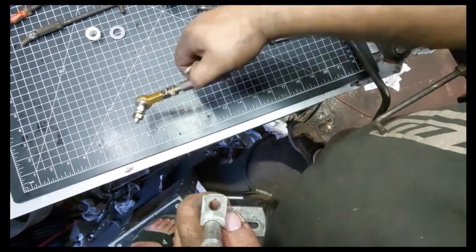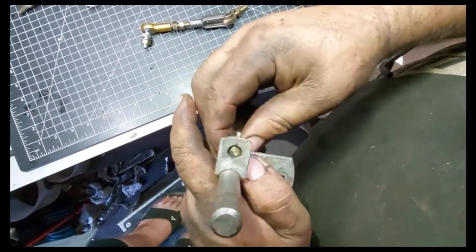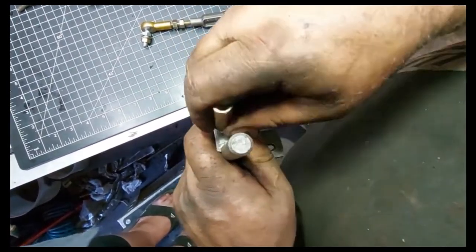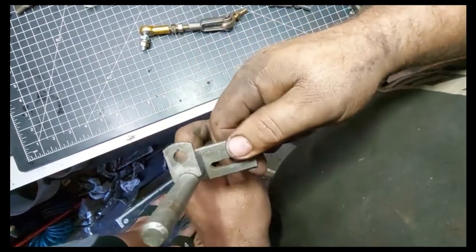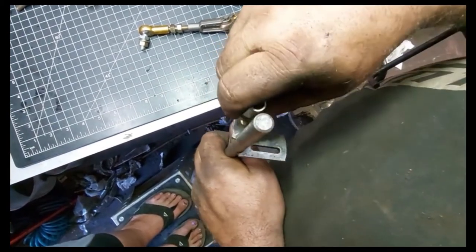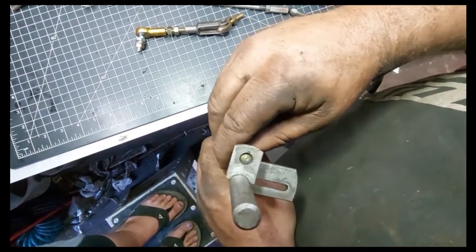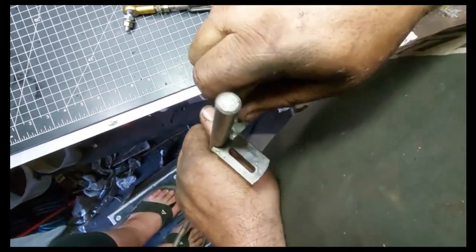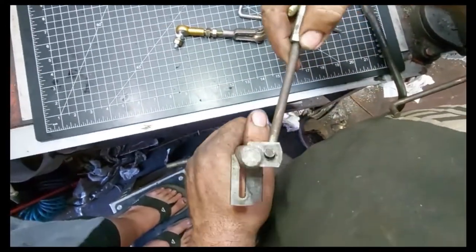With our new end, which is the same size as this, it doesn't. You might have to open this up here. Some drop right through, depending on wear. Others, you have to take a file, a reamer, a small drill bit, a Dremel tool, and open it up. But once you do, this is in here tight, and you've got a nice fit. There's zero slop, unlike this thing that's all over the place.